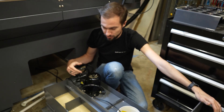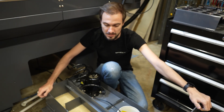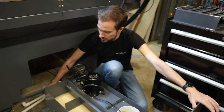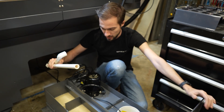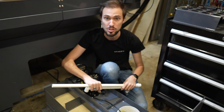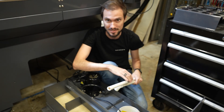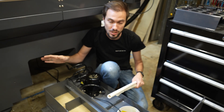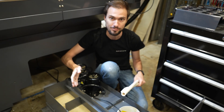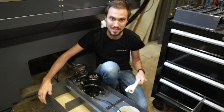There is a flexible, compliant cable that lets you pull it some of the way out without needing to do this, but unfortunately that doesn't work for me. So my plan is I'm going to use some PVC pipe to build a rigid assembly that sticks out of that port in the back of the machine, and then I'll be able to tie the electrical cables off to that assembly so that everything gets pulled through the machine when I slide this back in. I don't have to fish anything through that tiny port — it'll all just come out on its own and I can connect it on the back side of the machine.